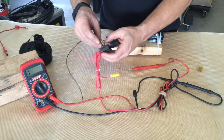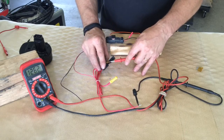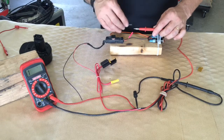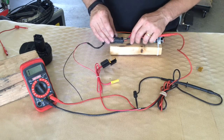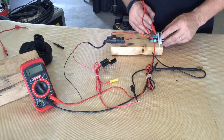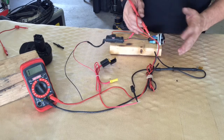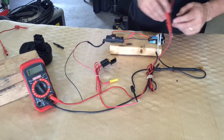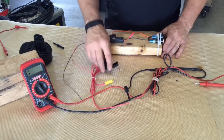That was a problem, but it wasn't the solution maybe. Maybe we keep popping that fuse because there's a different problem. So we're going to continue checking our circuit. We've replaced the fuse - we have power through there. The power comes through and it's going to go to this test port. We're going to test the backside of our plug again - we have a good circuit there. We have good power coming into the switch, and we have good power going through our switch. In our demonstration, we're assuming that the light bulb is burned out. We'd still have good power, but the light bulb is burned out, or something may have been shorted through there, which most likely would have caused the fuse to keep blowing.